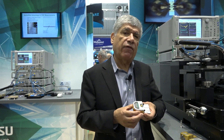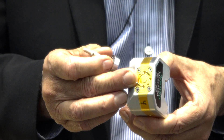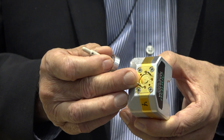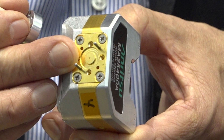The primary difference is that instead of supporting connectors, we are now going to a direct interface to the probes. Instead of developing a 0.6 millimeter connector, we have developed an interface that directly accepts our probe — it still has a center pin inside the airline, so it's still a pin DC-coupled type of connection, but without the threads.